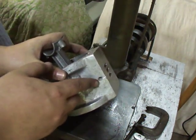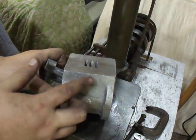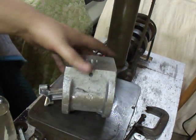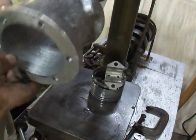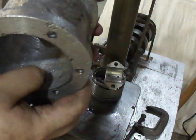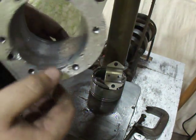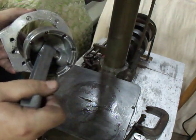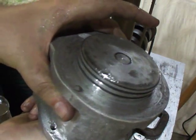I'll drill this out a little bit and put an eighth-inch NPT pipe tap in it so it'll have a place for the steam to exhaust to. I kind of screwed up with the Dremel and just caught the inside of that — you can't even feel it, you just see it. I'm hoping I can just hone that out when I hone the cylinder because it still has a rough feeling, and I've got more than enough room to hone it because as you can see there is no gap — it's still a little tight.